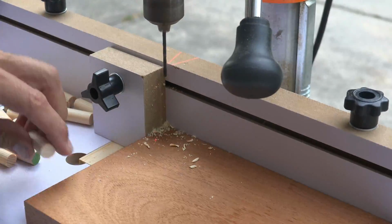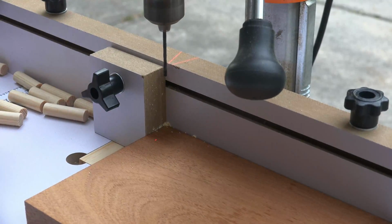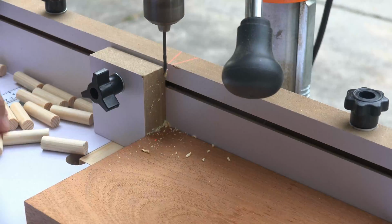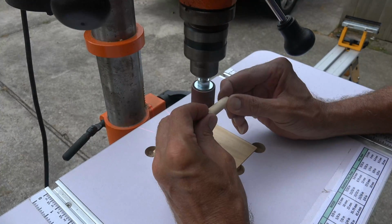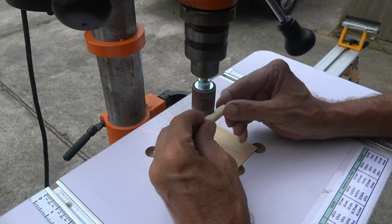I cut a few extra pegs just in case, and then my next step was to place countersink holes in each peg. This would help guide and keep the screws in the center of each peg as I mounted them. I then put a sanding wheel on my drill and sanded out a small valley that would act as a divot for each wand to sit in.